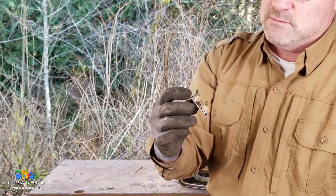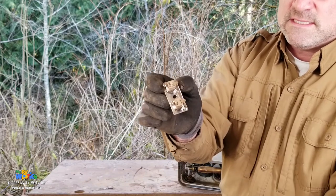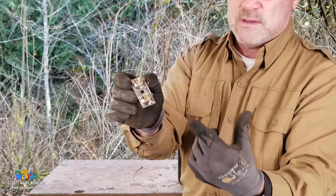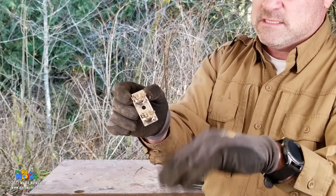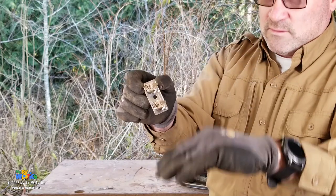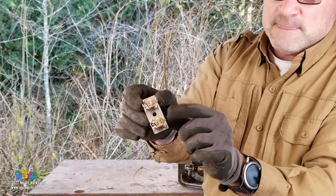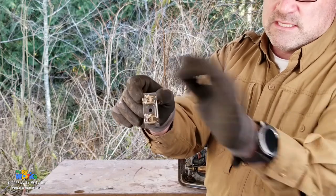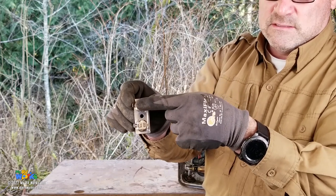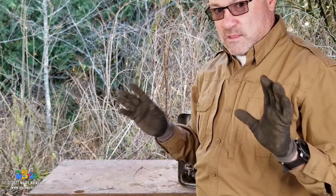Okay, so this was our DC one. 140 degrees is your water temperature. On, off, on, off. If I'm less than, I'm going to turn on. I believe 115 is where it kicks back on again. So it gets to 140, and I think 115 is a number, turns back on again, 140, 115, 140, 115. If this thermostat fails, and they do fail, then this guy is going to trip at 180 degrees, and that means he's going to trip out. Now, you can reset this guy, okay, but this whole thing is one part. Okay, so enough on the DC thermostat.